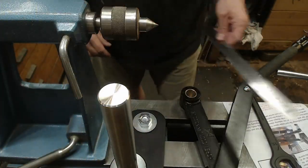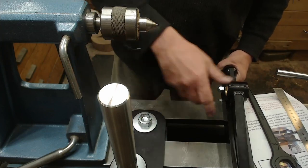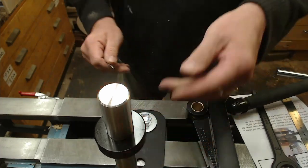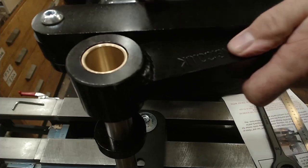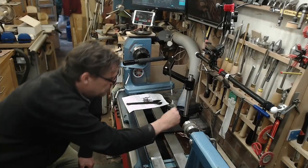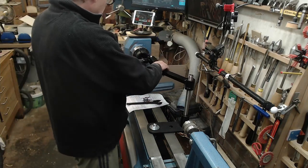You need to get the height of the arm at lathe center height. The center of the arm is the center of the first part of the bar, and that's held in position on the tool post with an adjustable collar. And then there's a lovely, very snug fit brass bushing in there. I'm just measuring — it's 29 centimeters from the top of that black plate to the center of that first arm.